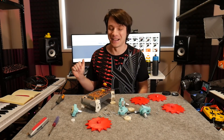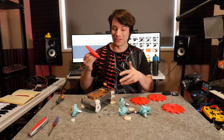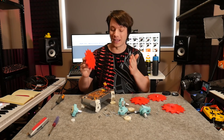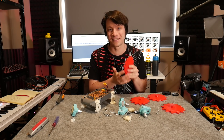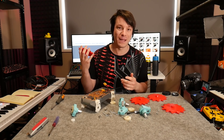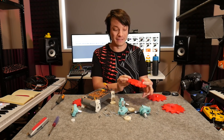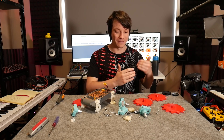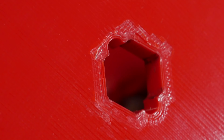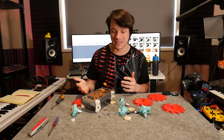I broke it completely - that's what I set out to do and it didn't take that long at all. These spiky wheels are just so aggressive. It's got tank steering, which is skid steer steering, so when I want to turn it drives one side forwards and one side backwards and turns on the spot by skidding. These spikes don't really skid - they dig right into the grass, and by doing that with a couple of hard accelerations it became very evident very quickly that something broke. In some cases one of the wheels actually broke - I think two of them broke where the layers of the 3D print met the hub. That makes sense because the layer bonding is the weakest point of the print, like wood grain, especially with high lateral load force acting like a lever and snapping the hub straight off.